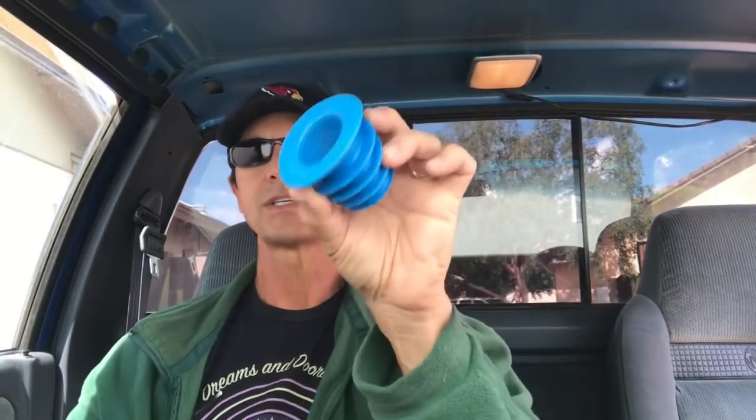You're not going to need the hose port really unless you want to replace a dedicated vacuum line. It also comes with an adapter, which is very important. This adapter fits into the suction opening in the skimmer in order to create a correctly sized opening for the vacuum hose to fit into. You might have to use it — if the suction port for the skimmer is not too big you can plug the hose directly in.